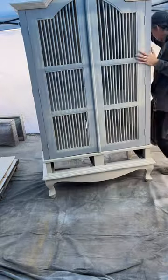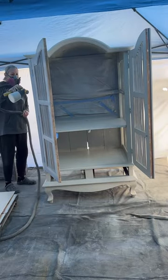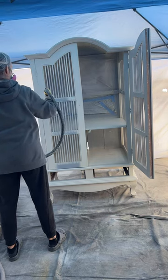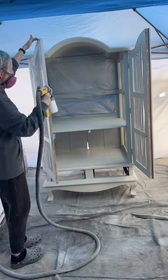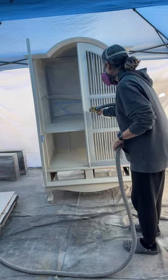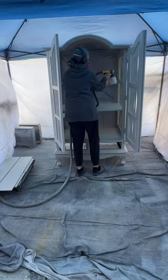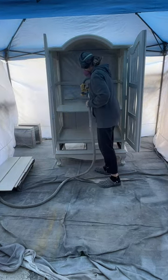Ready for lots and lots of paint. I also did three coats of paint — I'm using the Evolution line of Farmhouse Paints in the color Hybrid Beige. It's a really nice neutral, that kind of vintage white without being too yellow. This paint cures very hard and can be used indoor and outdoor. It has built-in primer and built-in top coat, but I still prime and top coat on top of it for added durability. Multiple layers of primer, multiple layers of paint, multiple layers of top coat — I just didn't show all of it.